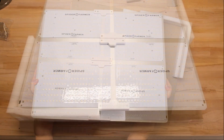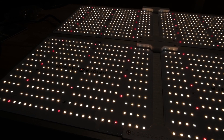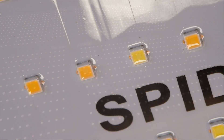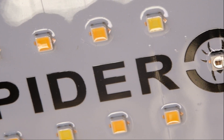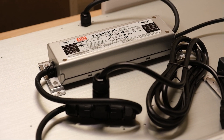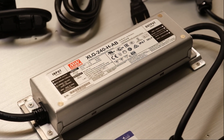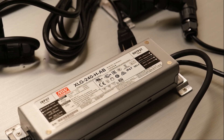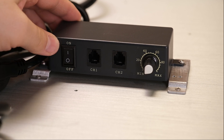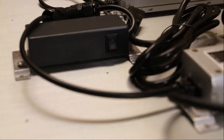The SF-4000 consists of 4 boards each built with Samsung LM301Bs in a mix of 3000K and 5000K color temperatures, as well as a handful of 660nm reds and a 760nm IR diode on each board. This light is powered by two Meanwell XLG240H AB drivers. For control there's a little box that sits on the top of the light, and on that there's an on/off switch, a dimming knob, and a switch that enables and disables dimming.